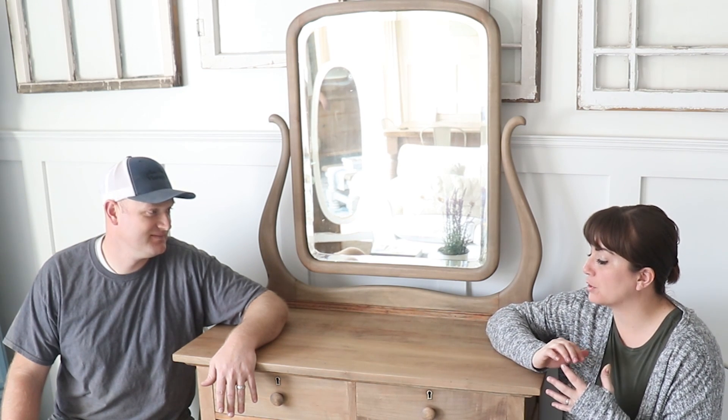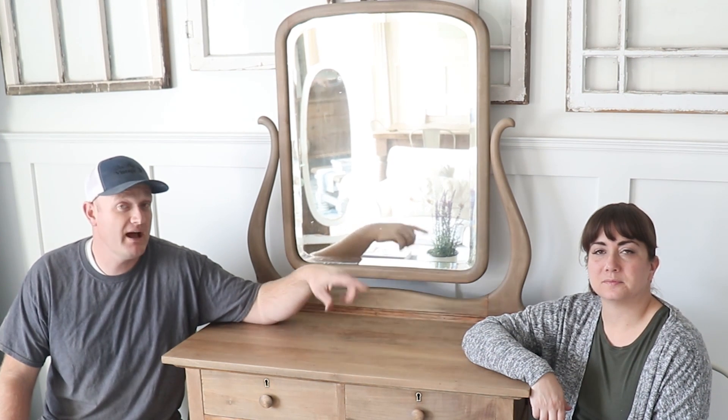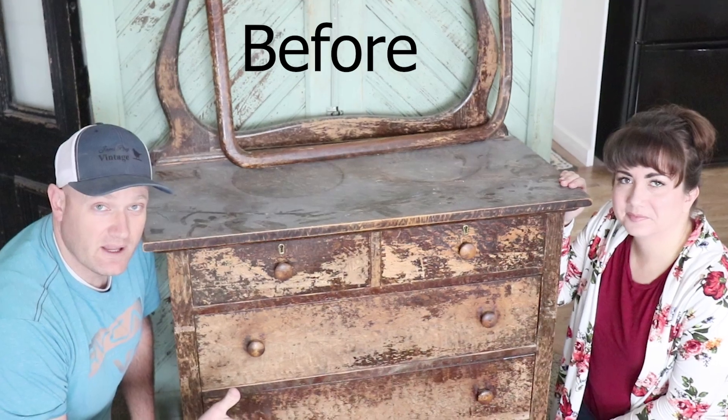It's all done! It took probably about eight hours to strip the whole thing down and refinish it, maybe nine if I'm being generous. The Real Stain number two is not a stain that sits and makes it all uniform — it's a reactive stain, so different wood will react different ways. There are a few areas where the tones are a little different because they're pine instead of oak, but overall I really love the muted look and it's much better than before — not yellow at all. The paint and varnish stripper we used is Clean Strip, and that's the same brand for the mineral spirits. I'll have the links down below. You can pick up the Real Stain number two and the top coat at jamierayvintage.com. We hope you enjoyed coming along with us on this part one and part two process — be sure to give us a thumbs up and subscribe.